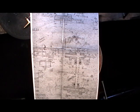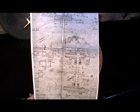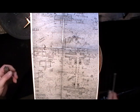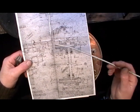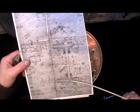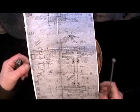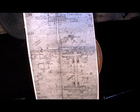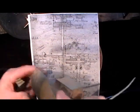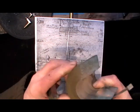Good morning. I'm back in my workshop and setting to on my next fittings for my boiler — the water gauge fittings. This is the drawing of the water gauges: there's one on each side, with a top housing and a bottom housing with your glass tube in the middle. I'm making these out of phosphor bronze, and I've shown in a previous clip where I was utilizing some bronze tubing I've had in stock for a long time, cutting segments out of it.